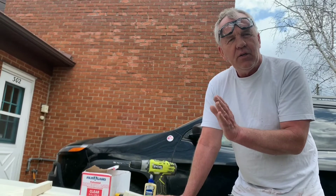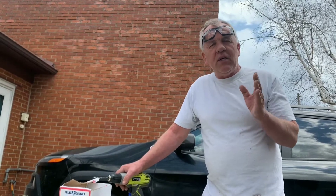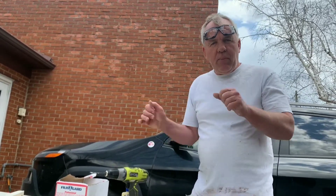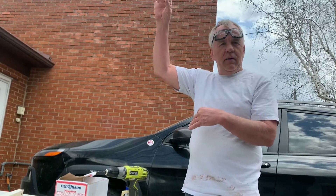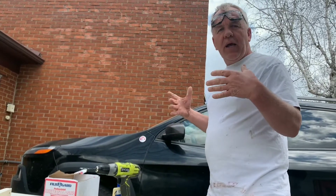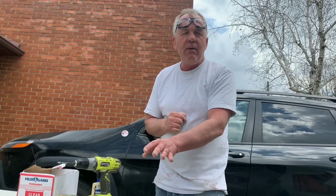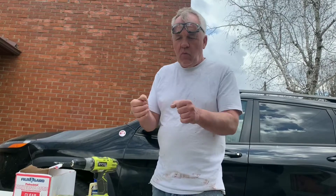I really don't recommend bifold doors. A lot of people ask if there's an alternative — yes, there is. You can buy pre-hung pantry doors with a bullet stop that are pre-hung. You can have pre-hungs where a three-year-old could swing on the doorknob and not tear it down. The problem with bifolds is a three-year-old will take these off their pivot — they're really cheesy. They're everywhere and everybody's got them, but it's not your only choice. Keep in mind, you can buy pantry pre-hung doors and have something that'll take the abuse.